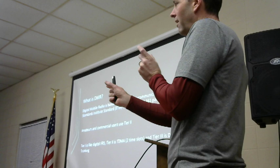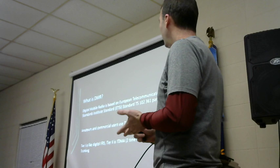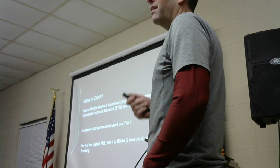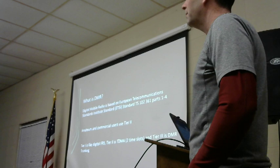The problem with Tier 1 is it's not like that. It's FDMA, kind of like D-Star or Fusion, or P25. It's one conversation on your repeater at a time. So if you get a Tier 1 radio and try to use it on the repeater, it's not going to work that well. So just be careful. Some of the Baofeng radios that are DMR are Tier 1. You just have to be really careful to look at the specs. Is it Tier 1 or Tier 2? Tier 3 is DMR trunking. I don't know if we'll ever get into that with amateur radio, but who knows?